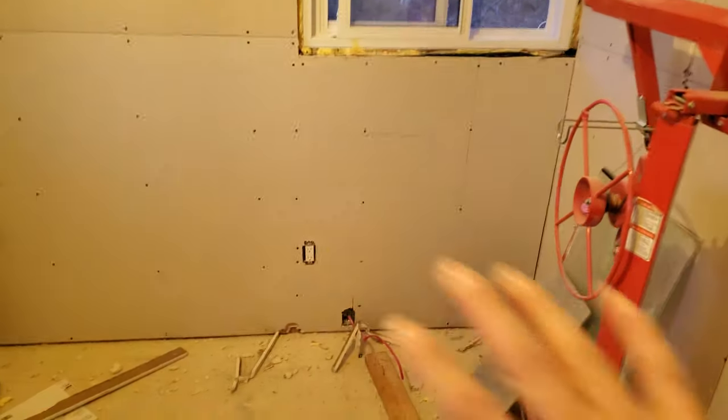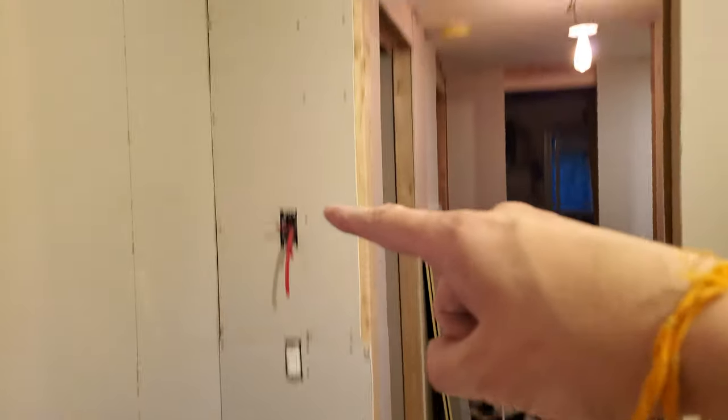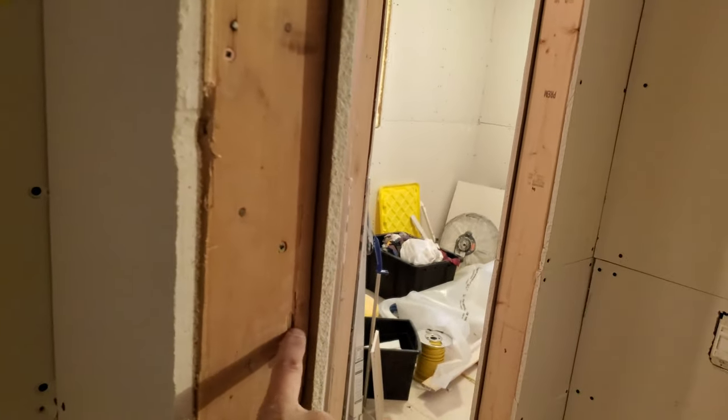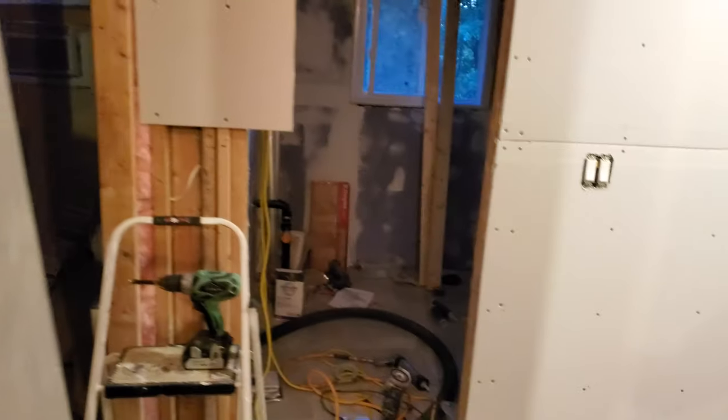So, end of a day's labors — this wall has been replaced. I finally got drywall up on the sides and the header, and that piece was replaced where I had to pull it down for the heating outlet. I got the inside here done, the whole thing, and the last of the inside of the closet. You'll notice there's some overhang here — measuring this stuff perfectly takes a really long time, so the intent is simply to get it up reasonably close, and then go around with the roto zip — or the DeWalt version of a roto zip, that puppy there.